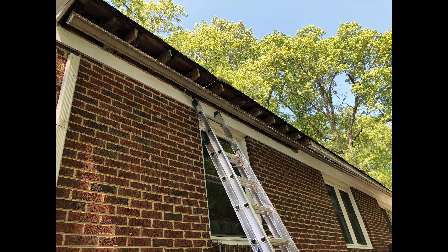From this picture you should be able to see that most of the boards up here that were used to support the fascia and the soffit have been replaced with the decking, so we've got a good solid basis to put new material on. I got a sheet of half-inch thick plywood - a four-by-eight sheet - and I'm going to cut it up into one-foot-wide sections to replace the soffit.